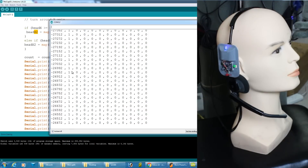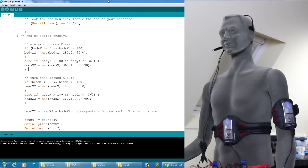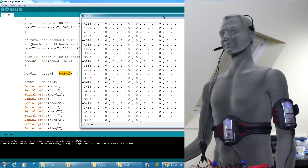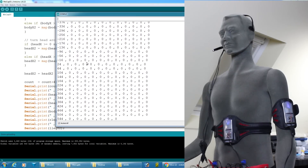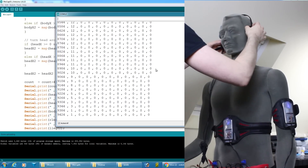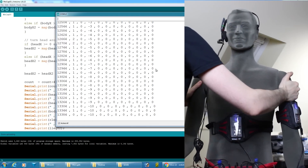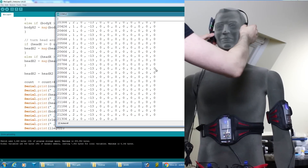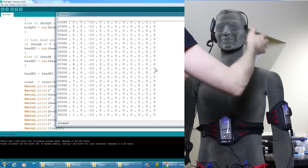The next thing is to compensate so that when I just move around in space it doesn't think all my arms and legs are moving. I can do that by using the body IMU to compensate — I can work out if I'm moving from that and take it off the others. I've done the same switch code for the body axis, then simply set the head as head minus body. So the first column is the head and the third column is the body — if I rotate the body and head together the third column counts up but the first one stays still, keeping everything relative to the body position.